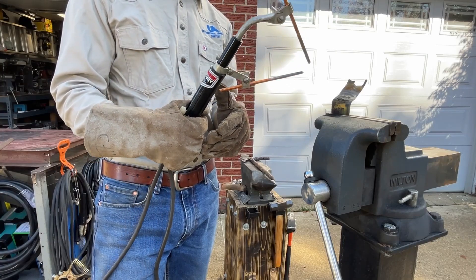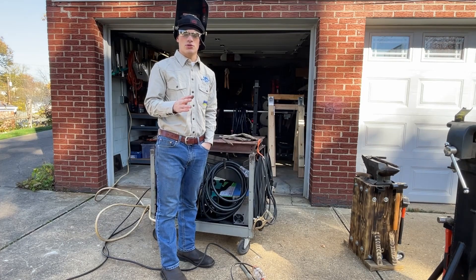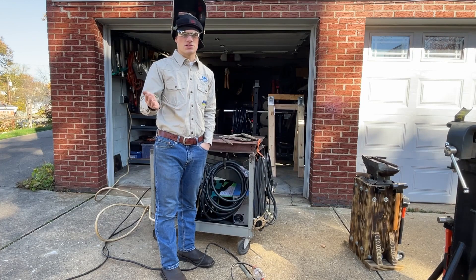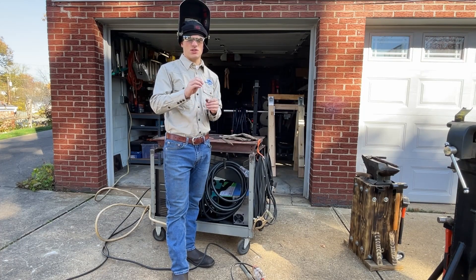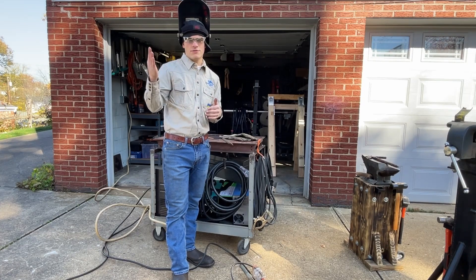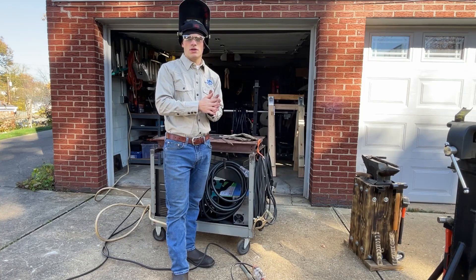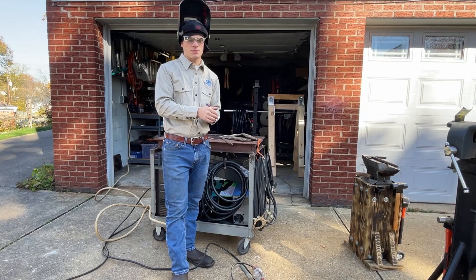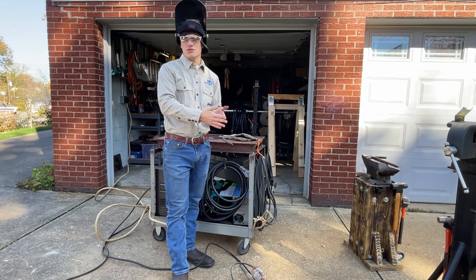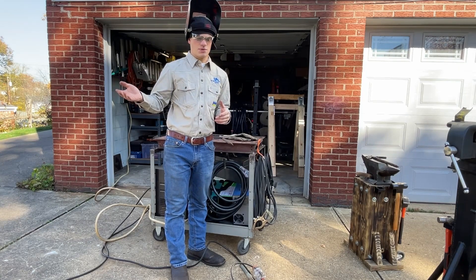So, the carbon arc torch — let's talk about amperage. For quarter inch I would use about 50 amps, and for 3/8 inch I would use 100 amps. You can fluctuate probably as much as 10 amps and not have a huge issue. If you go above 50 amps with quarter inch carbons, you're not really gaining any more heat — you're just burning away those carbons faster. For 5/16 inch you could do roughly 75 amps splitting the difference. I think if you've got quarter inch for smaller stuff and 3/8 for bigger stuff, you're pretty much set.